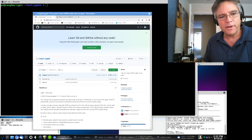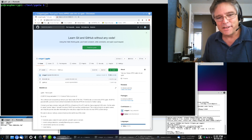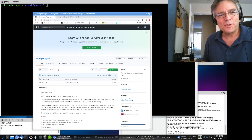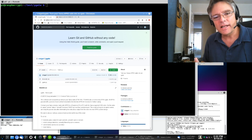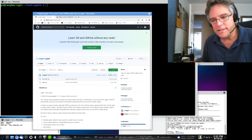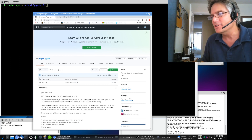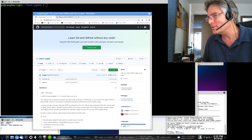So if you want to send an APRS message on your walk somewhere with your HT, you could send it to someone in Switzerland. When you transmit, your iGate will pick that up, forward it to the APRS information service, and that will relay it to APRS transmitters in Switzerland so your intended target could pick it up. APRS has all kinds of cool capabilities — you can do email, SMS texting. It's not just for position reporting.